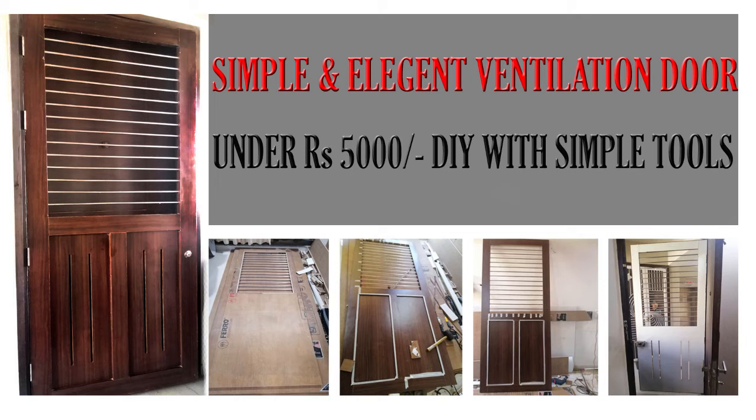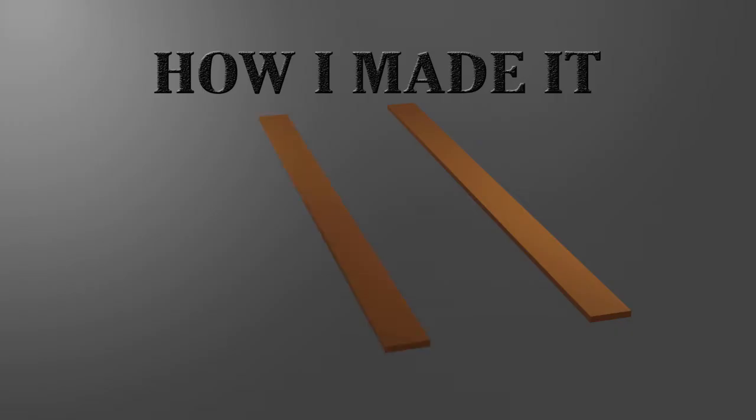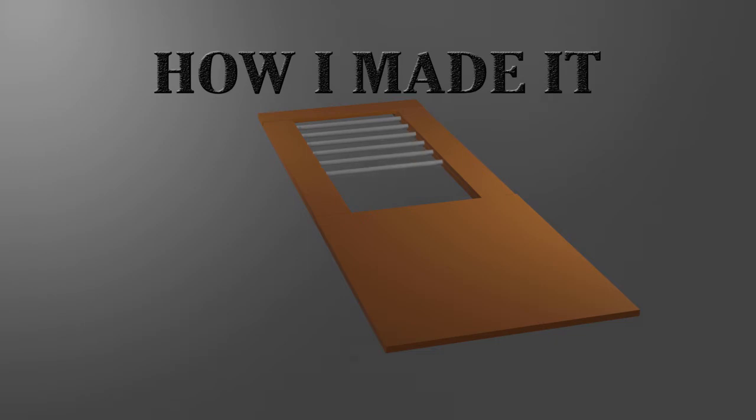Welcome back viewers. Today we will be doing a simple but elegant ventilation door with the help of 12mm MR grade plywood. 10 cm strips of 12mm plywood are made with the help of a circular saw. The strips are cut and assembled like this.